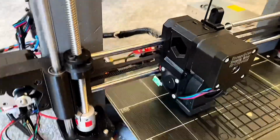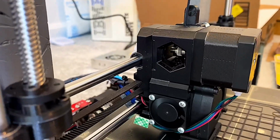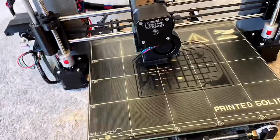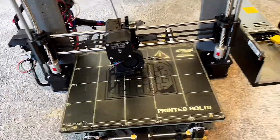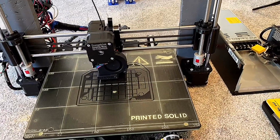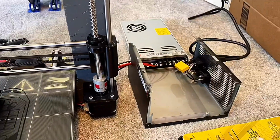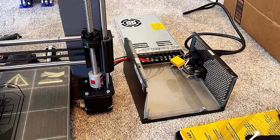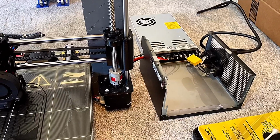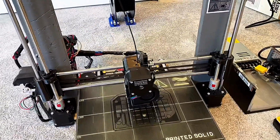Okay, we've got it printing. The gear that I was missing, the extruder gear, came in finally after ordering it from 3 different people. That's always fun. And what I did is I took apart and started using parts from an old ATX power supply. As you can see here, I need to print the mount for the power supply and properly wire it, but it's good enough to get the machine running.